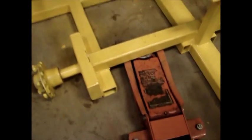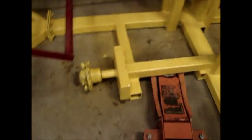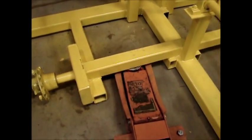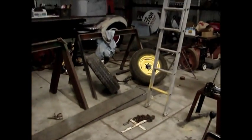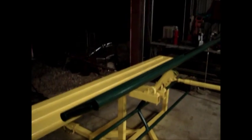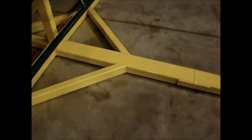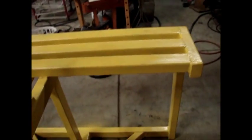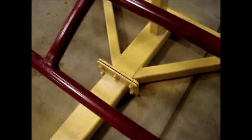This can also be pulled with a truck. This is a floor jack, and this is an axle here. You can just jack it up — it's got an offset so a floor jack will fit underneath there. Those are the tires over there that go on it. Once you have the tires on, you can come up to the front — this is a bigger bench that fits six people. You can set the jack right there and lift it up to the tongue. If you want to ship this thing, these are the two small benches that come undone right there.